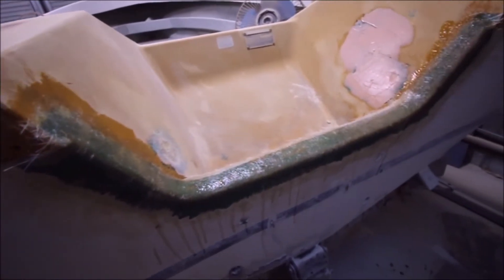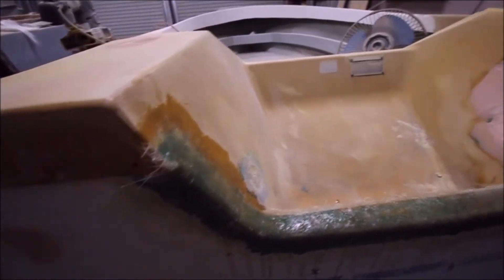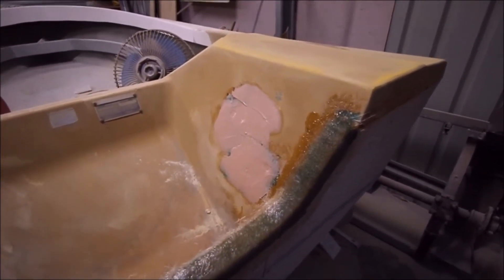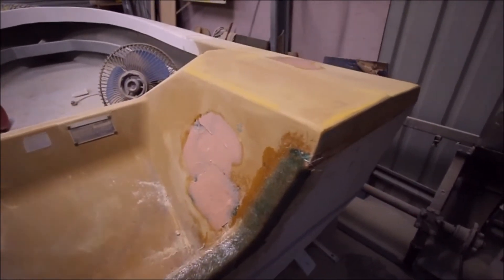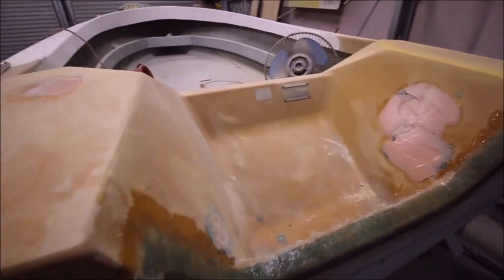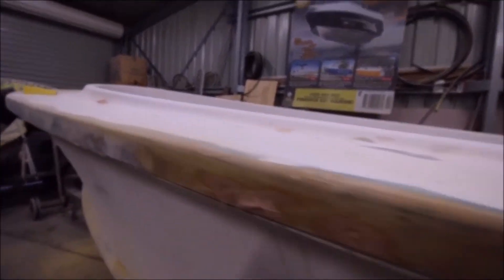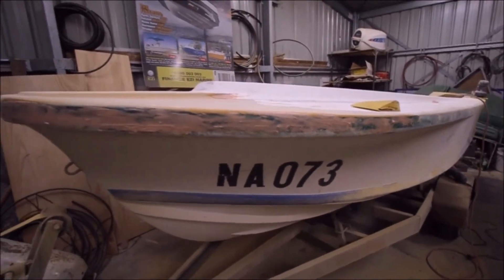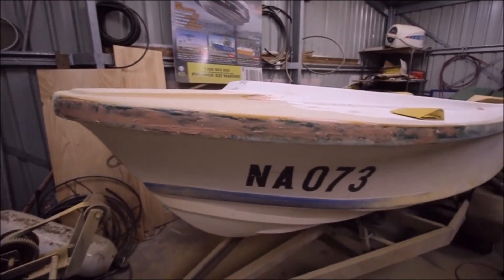It's all glassed up now. You can see how it's rolled right around the edges, so we're not going to get any dramas there whatsoever — no possibility of water getting in anywhere. I've also mixed up some body filler. I didn't film the body filler because it takes a while to mix up and you don't have a lot of time to get it out and get it spread. The secret with body filler: don't put it on too thick or you'll be sanding forever — you just don't need it. We've started to fill up a lot of the holes now to get up to final surface. I've even started filling some of the smaller holes in the gunnels as well.